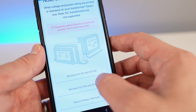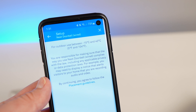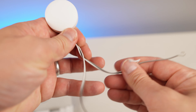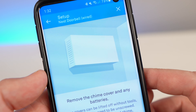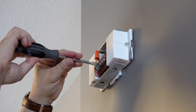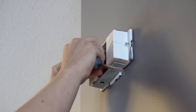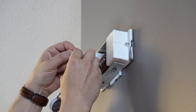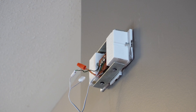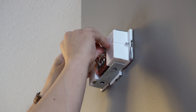Here's my actual doorbell and what it looks like inside — your doorbell may be different. You've got the voltage. They recommend turning off your power, so you're going to have to turn off a breaker if you wish to. Here's the recommended outdoor operating range: minus 15 Celsius to 40 Celsius. I've got three connections and I'm just loosening the wires on the existing doorbell. This is one of those old-fashioned ones with a metal rod pulled by an electromagnet. I've got one at the front door and one at the back door. It's going to be your own specific configuration — it might not be exactly the same wiring, so you'll have to check your wiring and the instructions on your phone.